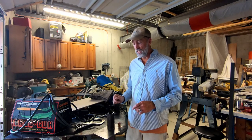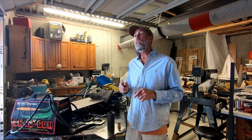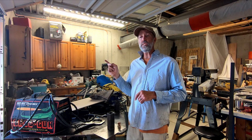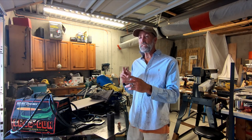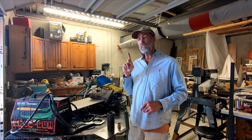So we're going to make two brackets to mount to the side wall, and one similar bracket that mounts to the ceiling. We have a sloped ceiling in this small bathroom, so it's a very three-dimensional puzzle. We'll have four points of contact, and only one will be these quarter inch rods suspended from the ceiling.